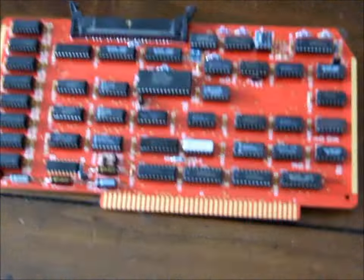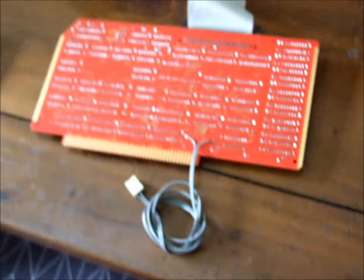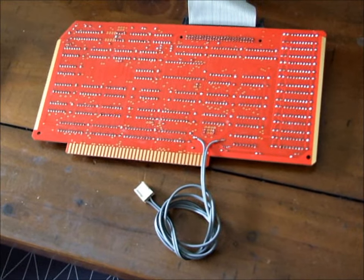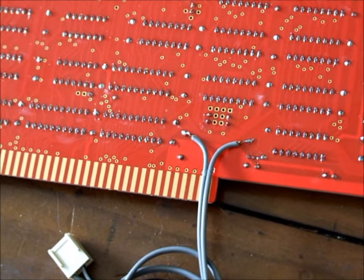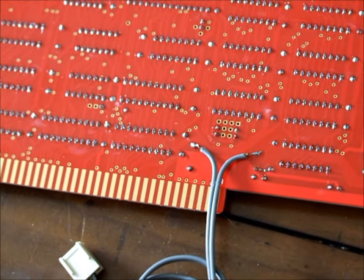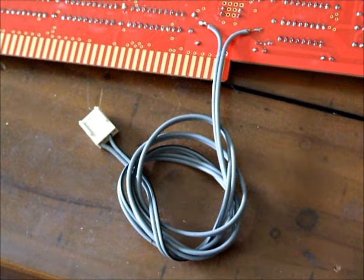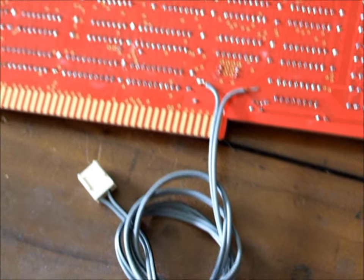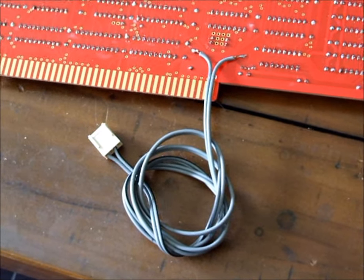There's nothing at the moment that I can do about that, but they do work. If you wish to power your FRED 48 or F48 from the controller you can do that — simply connect the two-wire power connection from the 5 volts and ground from this capacitor to a long enough cable, plug it into your FRED, and then when you switch it all on it will just boot up. There's no need to worry about an additional power source for your F48.